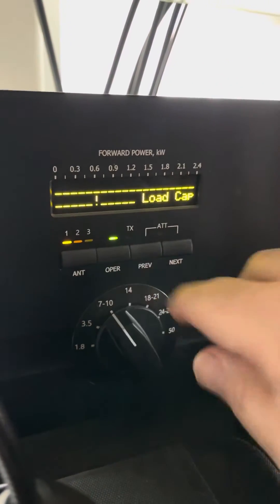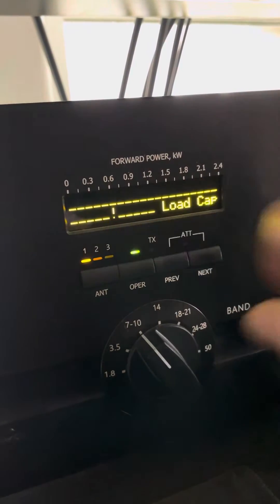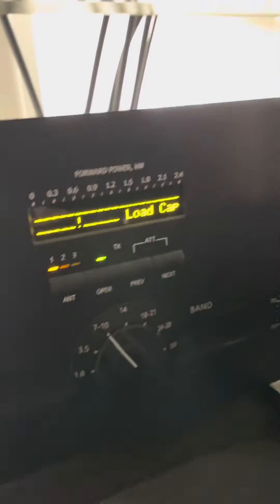Put it in line. This is how you tune — this is the tuning menu. I'm going to watch the arrow and bring it, and then turn the load knob to the direction indicated. So I want to go to the right, so that's good.